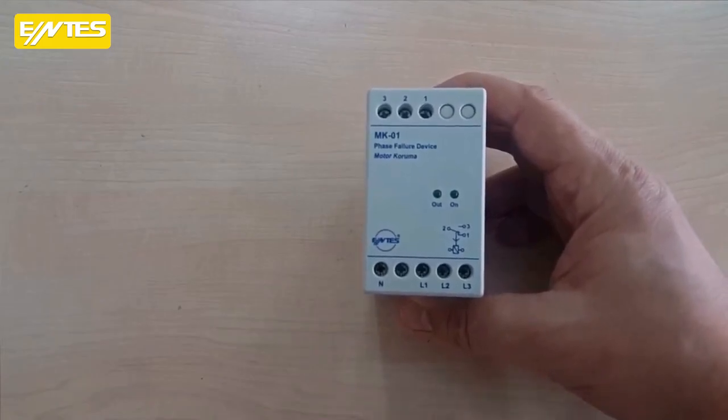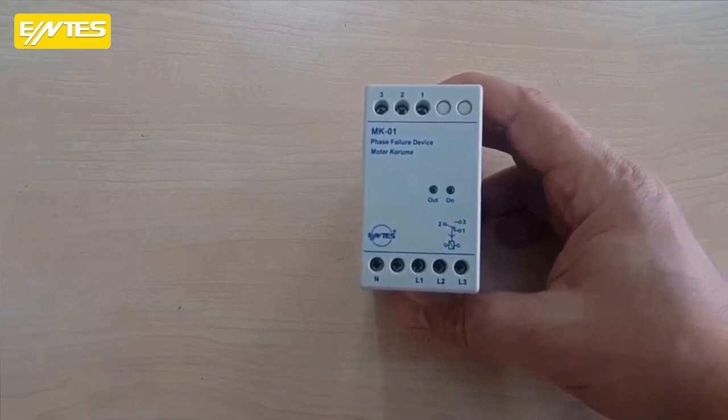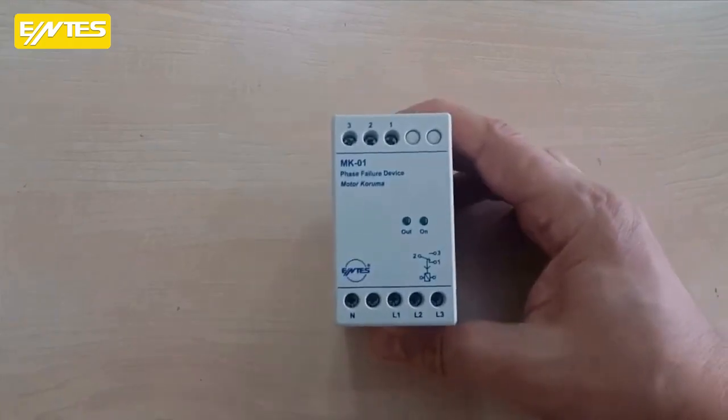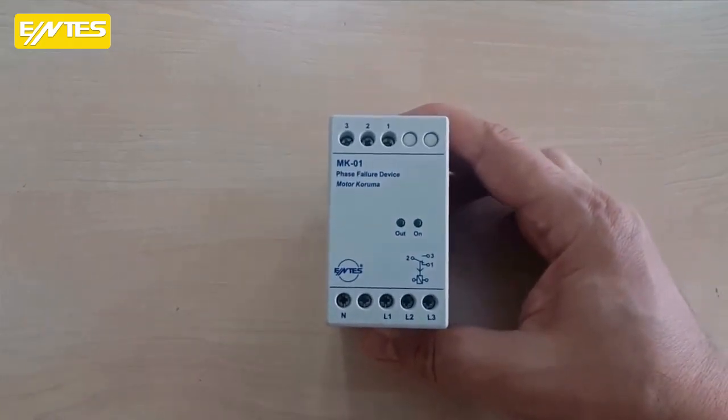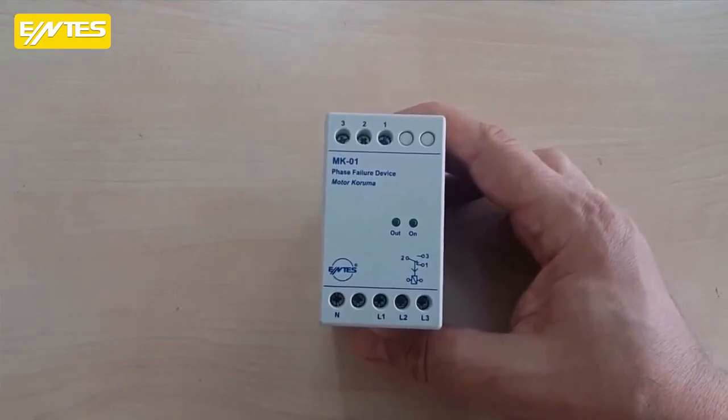If you look at our previous videos, we examined a relay called the phase sequence relay. I'll put the link in the description so you can check it out. This relay does not perform phase sequencing. It is specifically designed to prevent the motor from operating in 2 phases. Now there are a few different types of these relays.